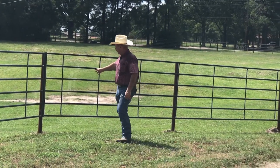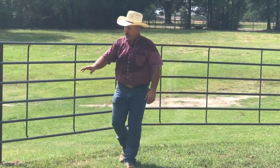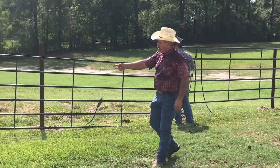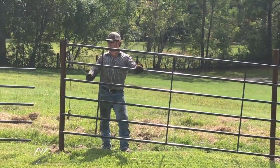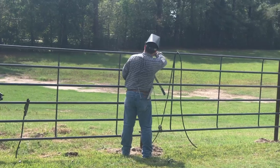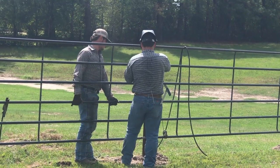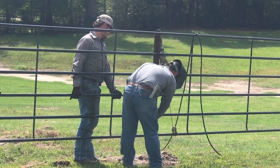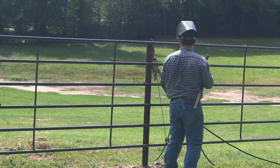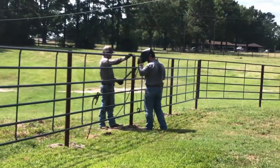We've come out of this corner and capped it with angle iron to make a nice, clean corner. We've got this first panel installed and we're getting ready to install the next panel. We've got a come-along hooked to it — he'll ratchet that up until it's roughly even with the top of the post. Then T will pick this up and sleeve the connectors in. It's a pretty simple process of just sliding in the six connectors into the end of the panel. Then you pull the panel tight — it makes a nice seamless look, and you're ready to weld this panel up and go on to the next.